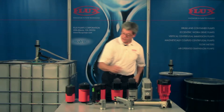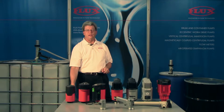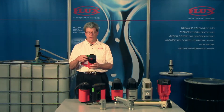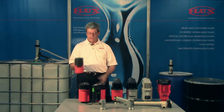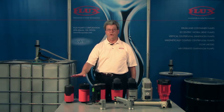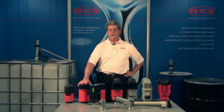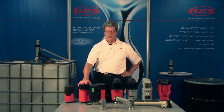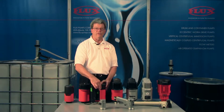The most popular motor — and these first three are our non-metallic motors — is the FEM 4070. This is a variable speed motor rated for 500 watts and it is considered to be an open motor, but still very corrosion resistant. Its bigger brother, the more powerful F457, is 800 watts and also available in the F457 EL, which is a variable speed version.